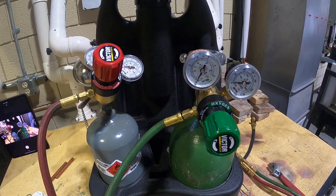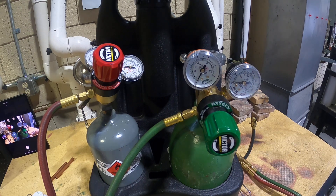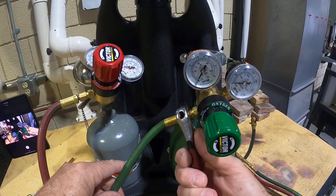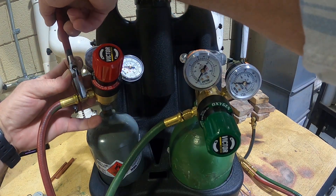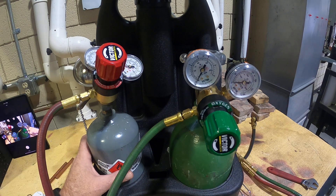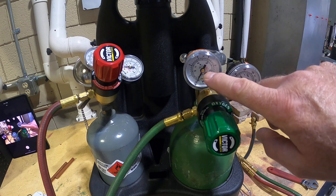In this video we're going to show how to set up an oxyacetylene torch rig. We have the oxygen tank on the right — it's a green tank with green hoses and a green knob. When hooking up the hose, oxygen uses standard right-tighty lefty-loosey threads, just like a garden hose. The acetylene side has reverse threads. On the oxygen side of the tank, we want the pressure set at about 20 psi — the right gauge shows how much oxygen you have left, and the left gauge shows the flow coming out of your torch.